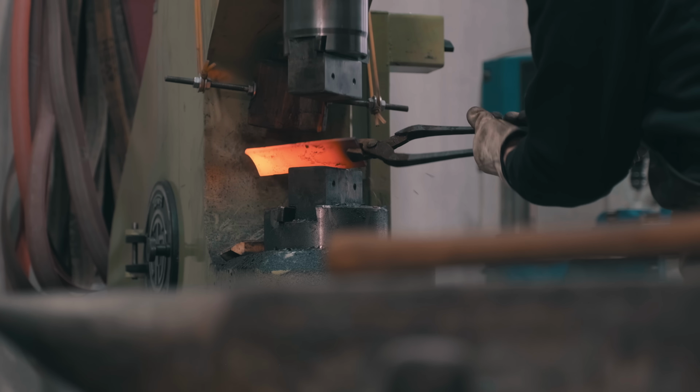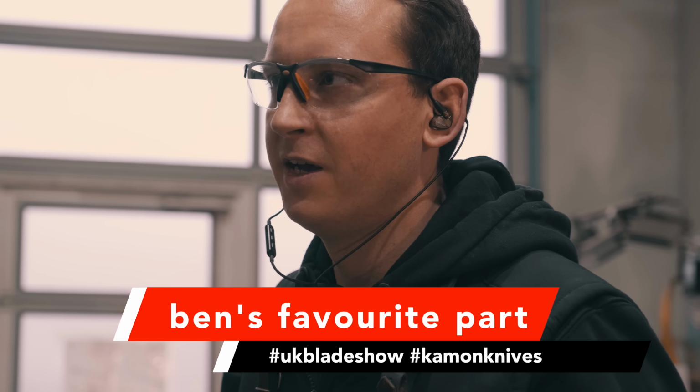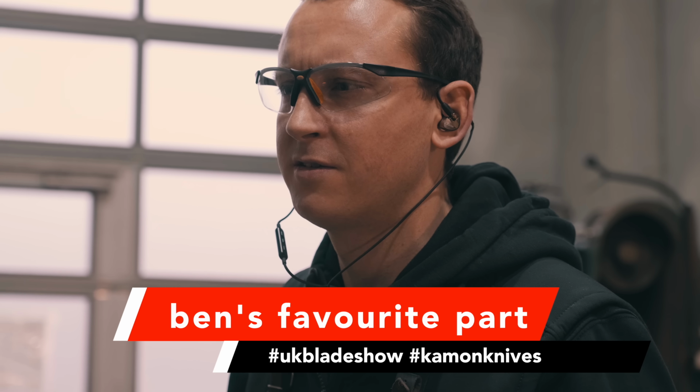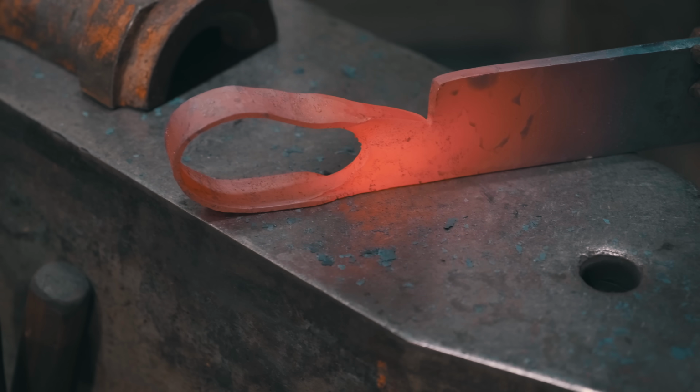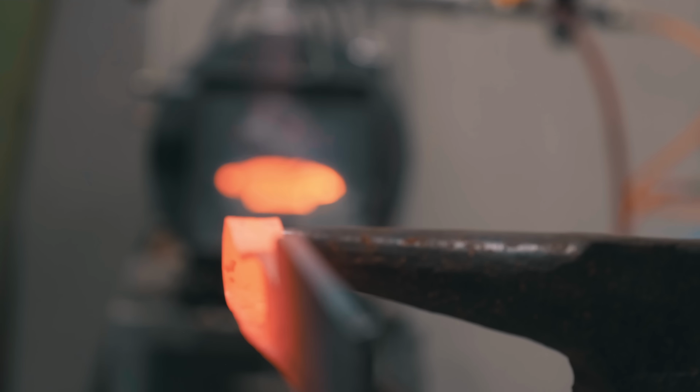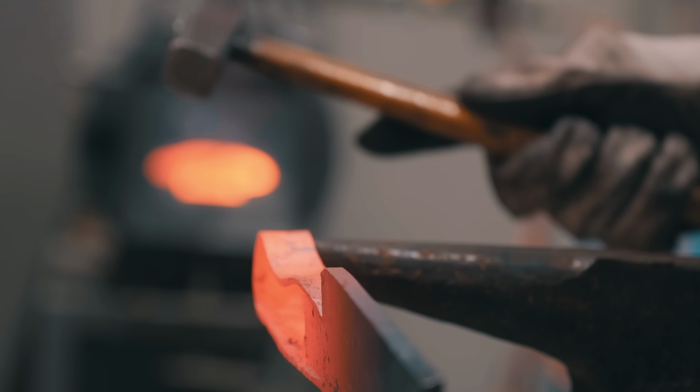Yeah, the most exciting part is surely the handle in that case. In principle, it's not a complicated concept because it's like a bottle opener in principle. Just the details, it's forged way more open than a bottle opener, and the width is different. The steel is more resistant to forging than what you'd use for a bottle opener.